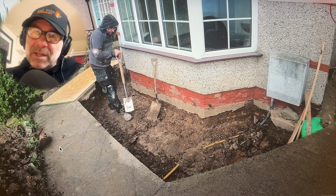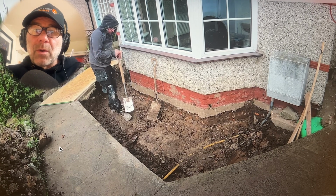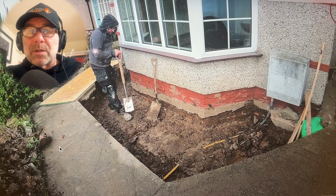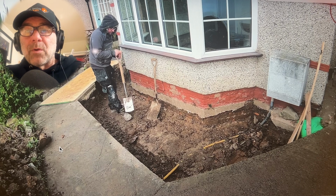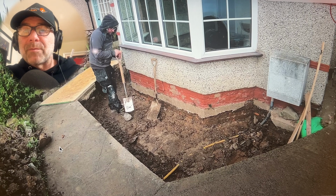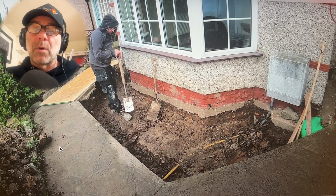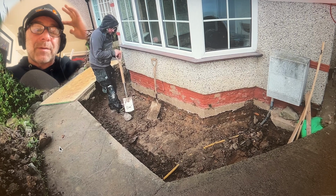I don't know. I wouldn't have said that he needs to dig that much up. If he's got downpipes and gullies, I'd be looking at the gullies. I'd have a drain survey done, get a camera down it, see whether it's cracked, have a look where the water's running to, because that sounds like it's probably running under the house. If there's been a burst water main in the road, contact the water board, ask them if they've had any burst pipes in that vicinity in the last few years, because if they have, the volume of water that comes out of a water pipe before the water gets to it will flood the ground around it, and it will also fill voids and create heads of water and stuff, which I think I've already talked about.